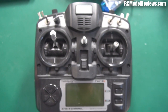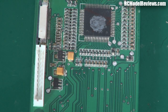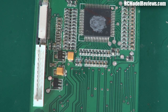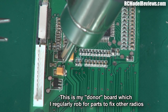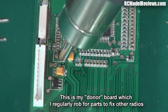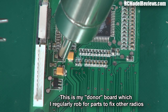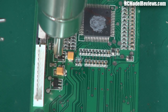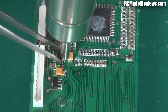That's usually the only real thing that goes wrong - sometimes the copper traces get a bit burnt. What I'm going to do is take this little regulator off the board using the hot air reflow gun. We've got to get enough heat onto that component to melt the solder. This is horrible lead-free solder so it takes a bit of heat - it's just a case of getting enough temperature in there to melt the solder without totally destroying the component.